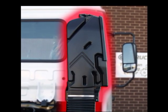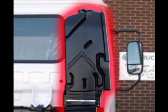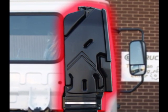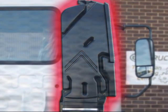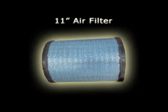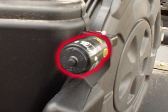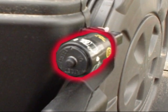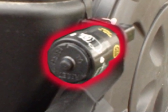To ensure the cleanest possible air intake for the most efficient combustion, the air intake system consists of the air intake snorkel and the air filter canister. The snorkel is mounted high on the cab and incorporates a screen over the intake port. As air is drawn through the snorkel, it passes through an 11-inch paper element where dust particles and water — which have a greater specific gravity than air — are removed by centrifugal force. Notice the external air restriction indicator for inspection, which will indicate whether the engine is receiving adequate airflow for efficient combustion.